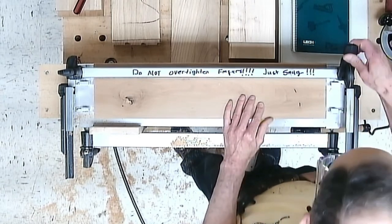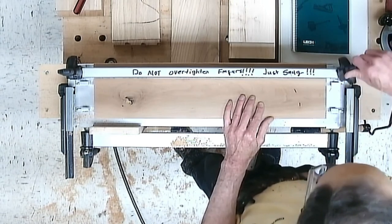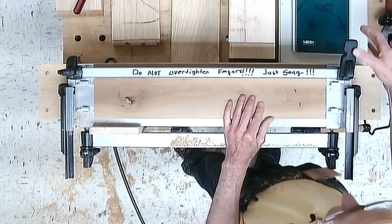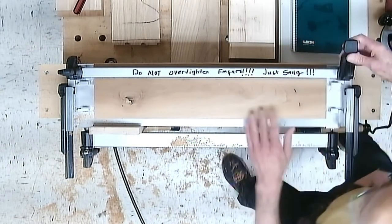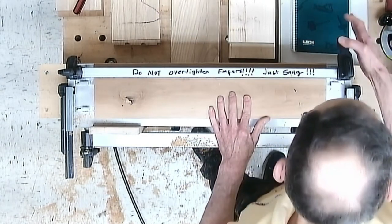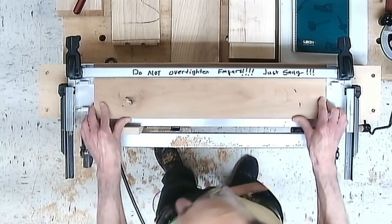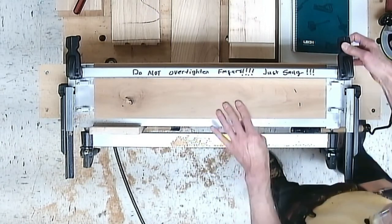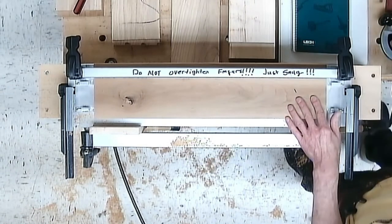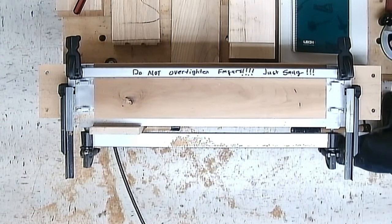I should be able to see, now that's too tight. And you loosen it just by spinning the speed clamp, but I should be able to clamp this with the thumb. And this is in the manual too. If you have to, all right, everybody stand back, then it's too tight. I should be able to, ooh, just like that. That's plenty tight. I would challenge you to pull that board out of there. It's not going anywhere. But these are plastic, they're not indestructible. So I'm sure your thumbs are stronger than mine in most cases. But that's all you need, just that one thumb pressure.